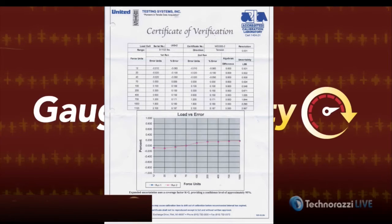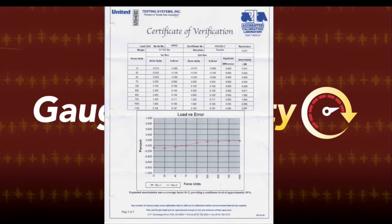The manufacturer and the model and the serial number, if one's available for that tool, also should be shown. Some tools do not have serial numbers. Some of the micrometers and calipers won't have a serial number on them, so we'll put whatever we can find on it. You can always find the manufacturer and model. That's always available. That should be on your calibration cert. You should look for that. Auditors will be looking for that.